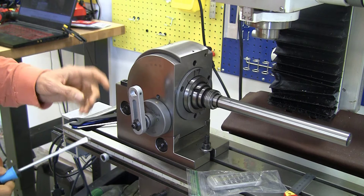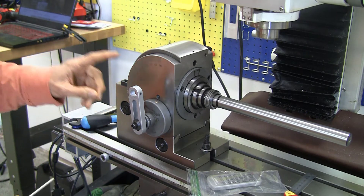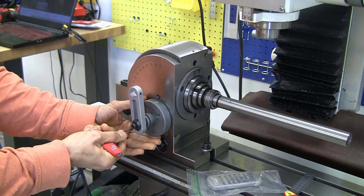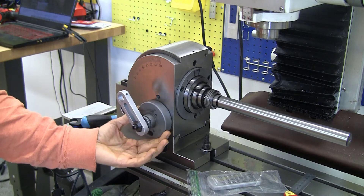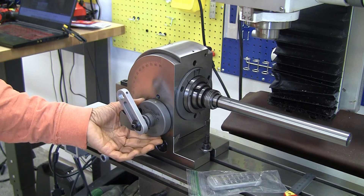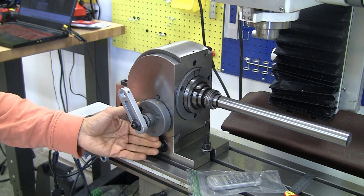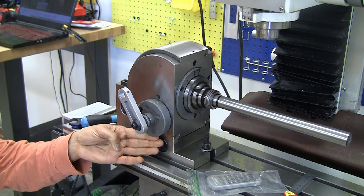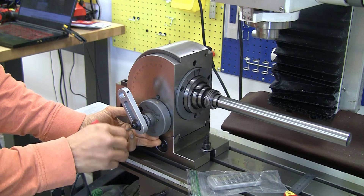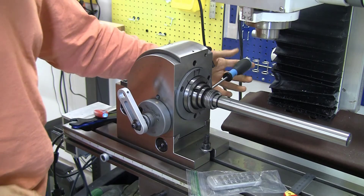Having set everything up, I'm going to start the process all over again. The first step is to loosen the screw holding the housing in place and rotate the housing anti-clockwise — this disengages the worm from the gear. Now turn it clockwise ever so slightly and keep going until you can feel the worm and the worm gear engage. Then tighten up the screw that holds the housing in place, making it as tight as you're going to set it, because that affects the backlash.